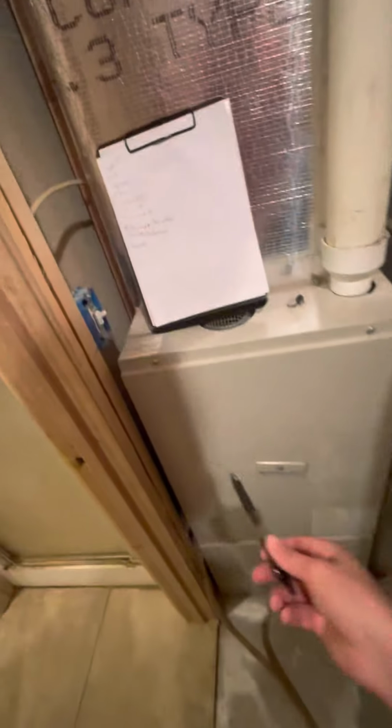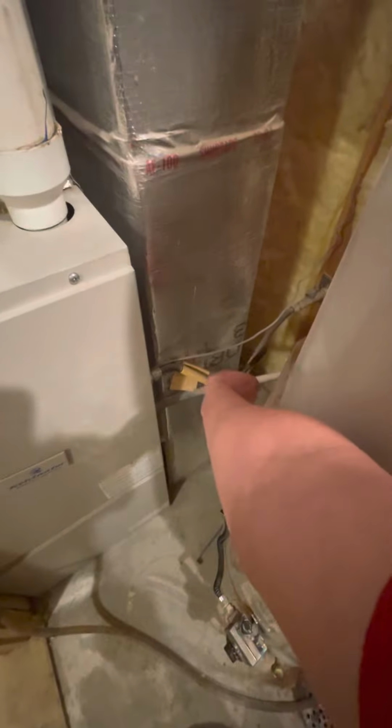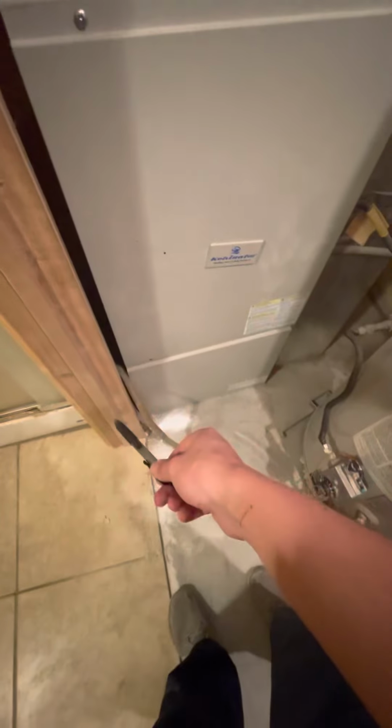Overall, it's going to be the main stuff, guys. You have electrical disconnect over here, natural gas coming in from this side, from flex all the way into hard pipe on the equipment, and then the drain line's actually coming kind of in a weird spot behind the system, into just a simple hose that's kind of clear see-through.